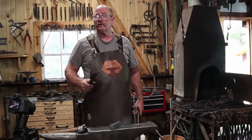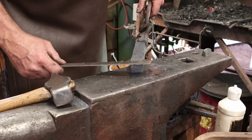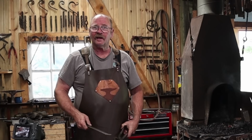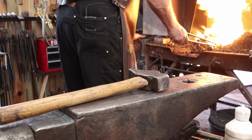We started off with 6.5 inches of wrought iron and about 3/4 inch of tool steel. And after doing some upsetting, we're now down to 5 3/4 inch. And our 1 inch dimension is now 1 1/4 inches square. I think I would like to upset this just a little bit more, and that will allow me a little bit more leeway in forging the final hammer. So let's put this back in, bring it up to welding heat again.